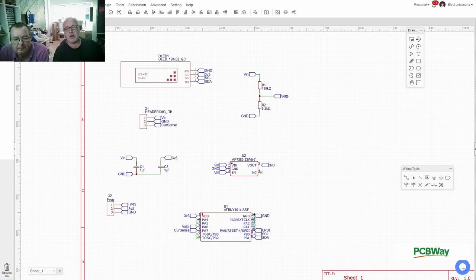We'll keep the OLED module over here. We'll keep this as a module. These modules are not that complicated. There are some caps, some resistors on there, but there's a flex cable on this, and this is horrible to solder for me. So we'll keep this, and in fact, they are cheaper if you buy the module. You buy the module, it's cheaper than getting the little display and getting all the components.